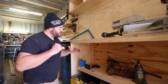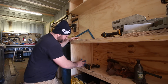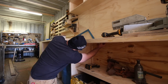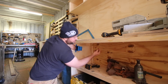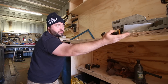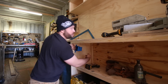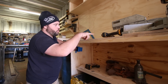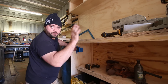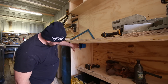Like I was saying with the sawdust — I don't want it getting injected into outlets. What I think I'm going to do is install an outlet box here, and I will drill some large holes right here for power cords to go down through. The chop saw is going to end up in this area, so the cord is going to come down through here. I'll probably put a hole or two up top to drop cords down and connect them in here for permanent-type stuff.